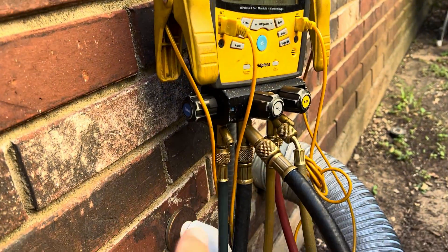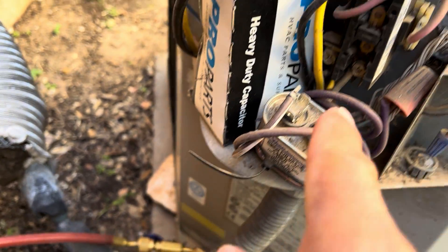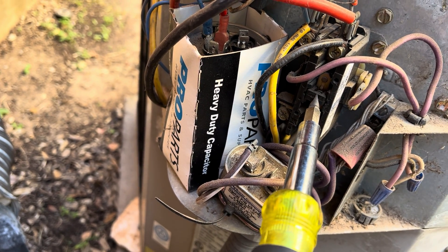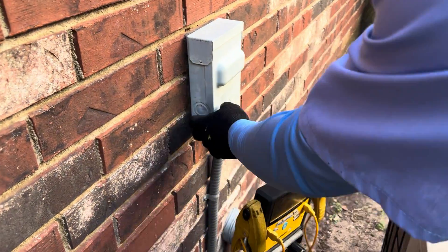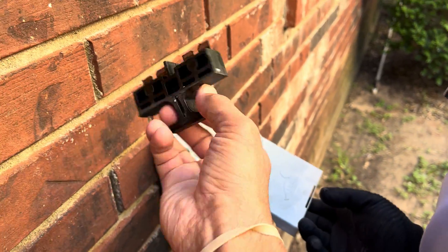What he pushed earlier — this is your contactor. This is the power that comes in; it comes in and goes to a white one and a black one. When they push the contactor, there's power. Now since we're done, we want to disconnect the unit from power, so we come up here, open that — it's called a disconnect — and we pull that out. This is called a pull-out.